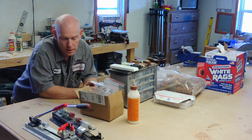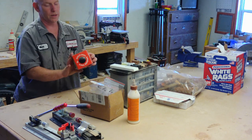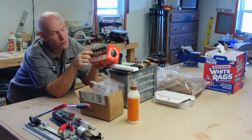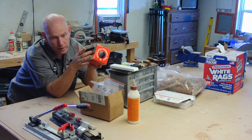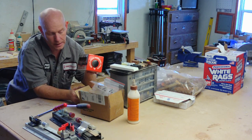Once you've turned it, now you've got to sand it. You need sanding packs that come in 150, 240, 320, 400, and 600 grit. If you're doing wooden pens, this is fine — you will run through up to 600 grit and you'll be done sanding.